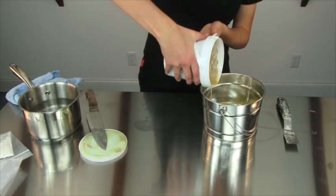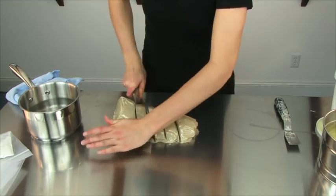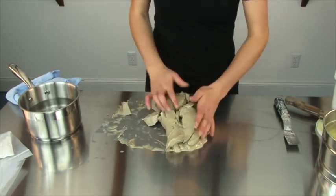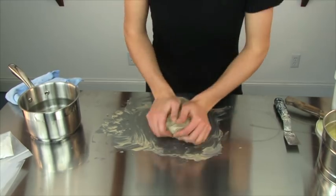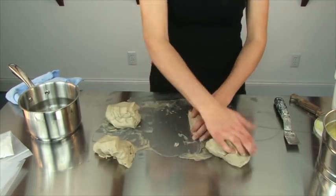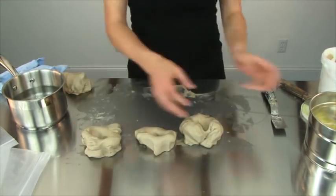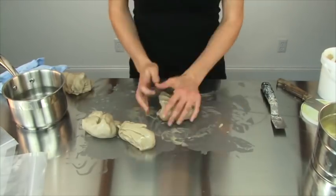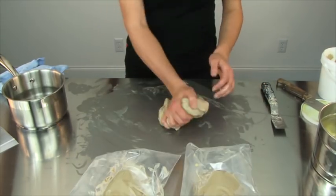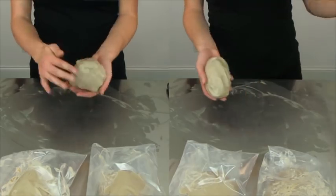Pour off excess oil if needed and put aside. Empty the container onto a clean, dry surface and cut into pieces. If the putty is hard, use a knife to cut into smaller pieces and begin to massage like dough. Only use the provided chalk on your hands — do not add chalk to the putty. When the putty becomes smooth and pliable, divide into quarters with a knife and massage individually. Most likely you will not need all of the putty. You can put the excess raw linseed oil back into whatever putty you do not plan on using right away and store in plastic bags or even freeze. If you store putty in a freezer it will prevent the oil from separating again. Continue to massage until the putty texture is smooth and keeps its form well, then place back into the container until needed.